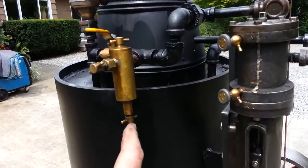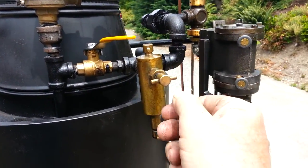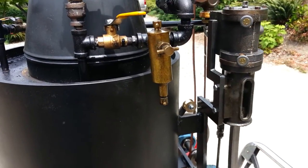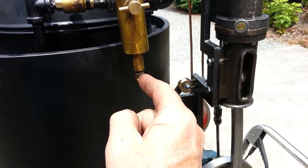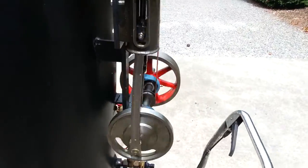The oiler is right here. I've got it open about a half a turn. You do need to put oil in here. And this is another thing you need to winterize — open this end of it and drain all the water out of it. That's important too.